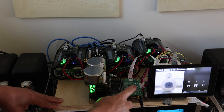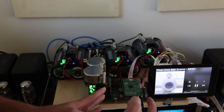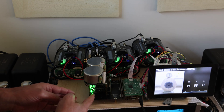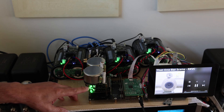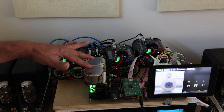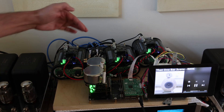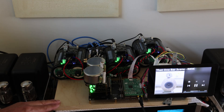The heart of the system, as you all know, is a Raspberry Pi — and it's right here, you can see it. That's what we call the dirty side. Then it goes into the side here through the FIFO Pi and the dual mono DAC, and then it goes into four transformers. That goes out as XLR and then into the pre-amplifier.